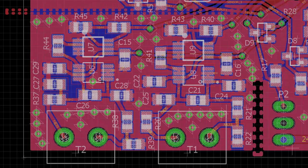I then removed the heat gun and pointed it at my thermocouple wires, not at the board, but at the thermocouple wires right before the connector. And guess what happened? The temperature of the thermocouples dropped below the ambient temperature, or the temperature being measured, because I made the actual reference junction hotter than the reference junction I was measuring. So anyway, that's a real life story.